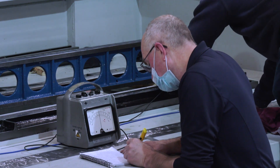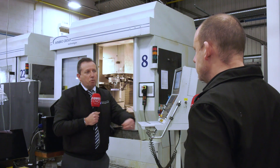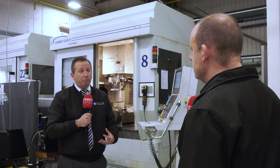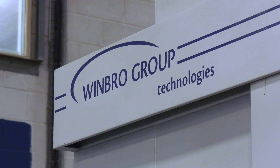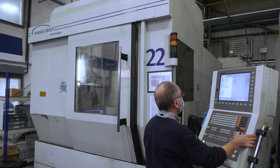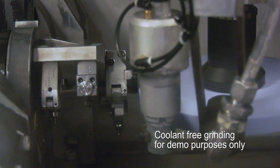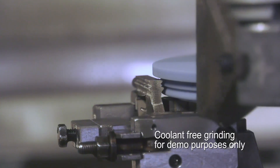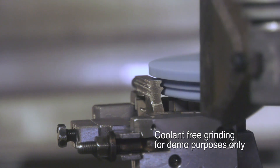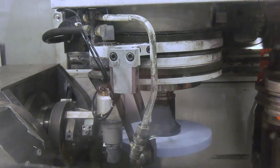Where's your market? We see making turbine blades here, but beyond that maybe? Well, it's predominantly being used in the aerospace industry for producing the fir tree roots for turbine blades. But where we see creep feed grinding now, with our other technologies around the medical industry as well, there's a lot of product there with very clever grinding processes that we think, between the laser techniques and the grinding techniques, really gives us a major sell to offer.